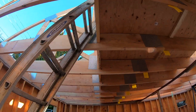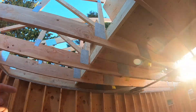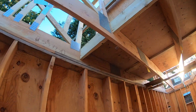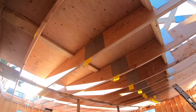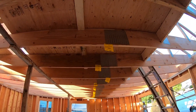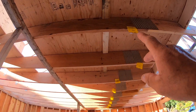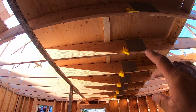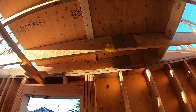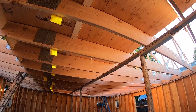I just used a two by eight — it's a two by 12 bottom cord, but I used a two by eight, so we have plenty of room for passing cables, pipes, whatever we may need to pass through there. The plans called out for tongue and groove OSB, so I'm using real three quarter inch plywood and we are just butt blocking the seams — it's a much better joint, much better way to do it. And with that farm pack of wood, I have lots of extra lumber to work with.